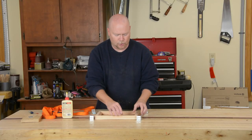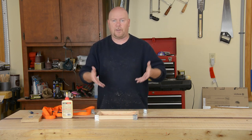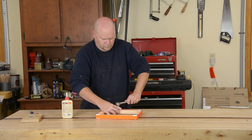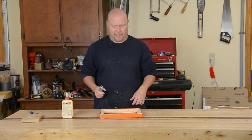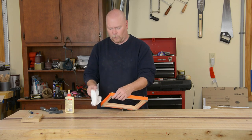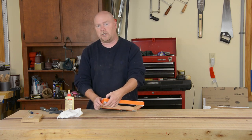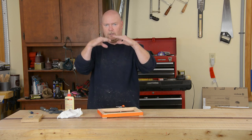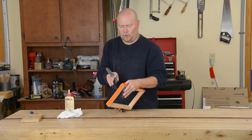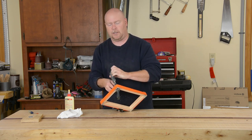Yes, I really am just putting yellow glue on a miter joint with no other fasteners. This thing is going to get filled with epoxy and have a solid back epoxied on it — these miters are not what's holding it together. Don't go crazy with the band clamp; there's bringing your glue joints together and there's turning this into a twisted pretzel. This is a painted project so I'm wiping the glue off the joints. It also gives me a chance to inspect my miters — they all line up tight on the joint, but sometimes they can get out of planar alignment. Simple enough: throw a clamp on there, tighten it down, and all of a sudden you're flush.